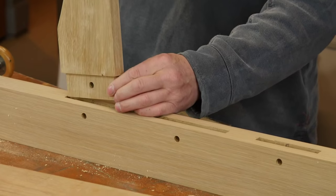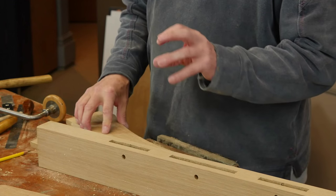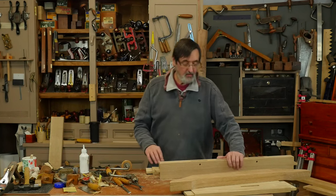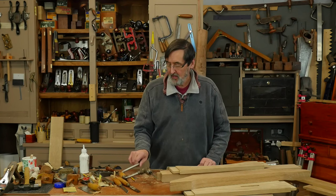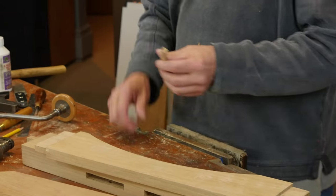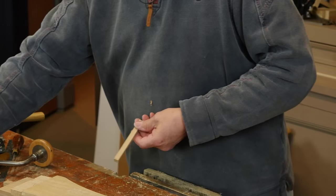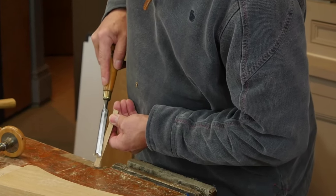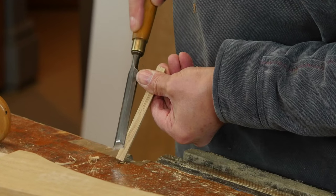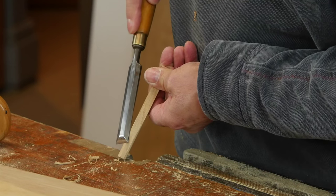This goes in here — I know I've got the right sized hole and the right step inside — so all I need now is the glue. I'll show you how I arrived at my dowel. This is the dowel piece; it fits the exact size of the hole. I've got a piece of 3/8 x 3/8 material, just slightly over 3/8, and what I do to start this dowel piece is take off the corners like this, just to get a start.